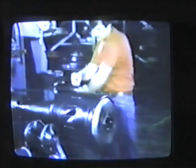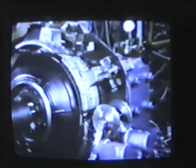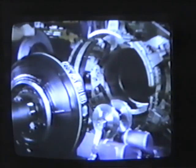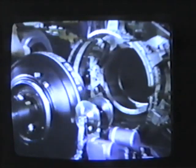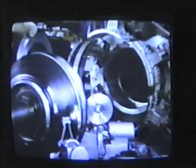Meanwhile, the operator has mounted the carcass from first stage assembly on an expansion mandrel where he adds his own identification numbers and inflates the carcass to receive the band assembly from the grab arm. Rollers move in to stitch the tread over the sidewalls and to knit all of the components together. This completes the assembly of the so-called green tire, which is now ready for curing.